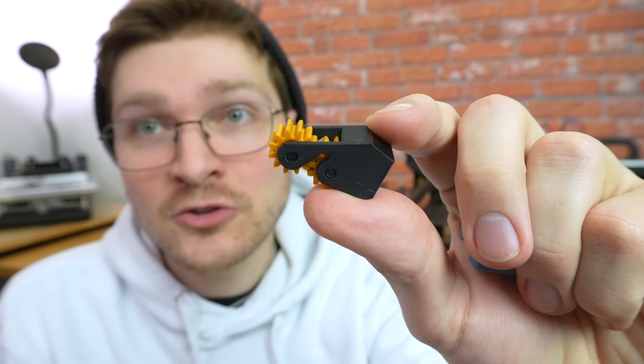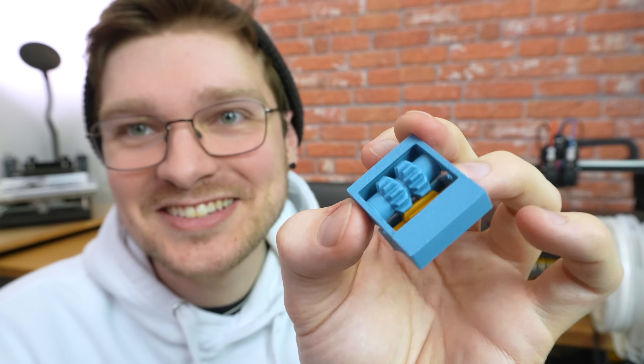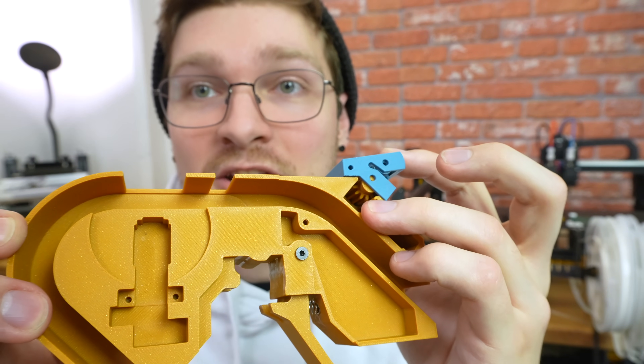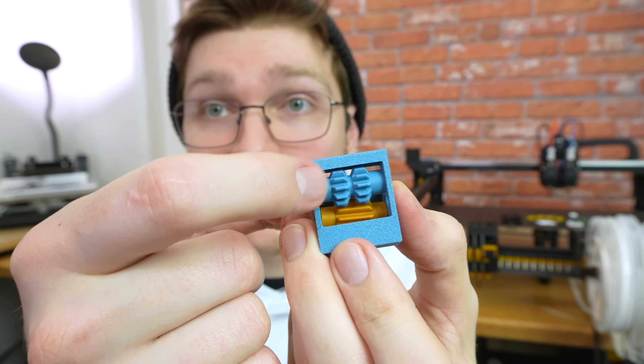The peel gears are cool. This is what we call the peel gear frame assembly that comes on the 8 and 12 millimeter feeders — it's a single black print with two gears attached, with a positive interface and pressure between them. There is a very slight flexure that allows this to slip a little bit when you overdrive the film. I'm trying to stick with this system for 16 and 24 millimeter. The new version is weird looking but it will sit on top of the feeder. The peel motor sits inside, the worm gear interfaces with the gear in the opening, and the film gets fed between the two gears and out the back side. The gears have no interface on the edges — only in the middle — so the adhesive doesn't stick to the gears.